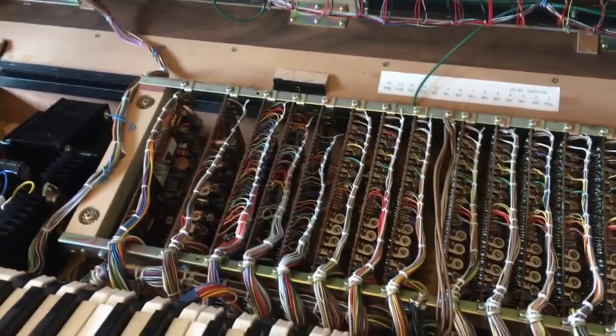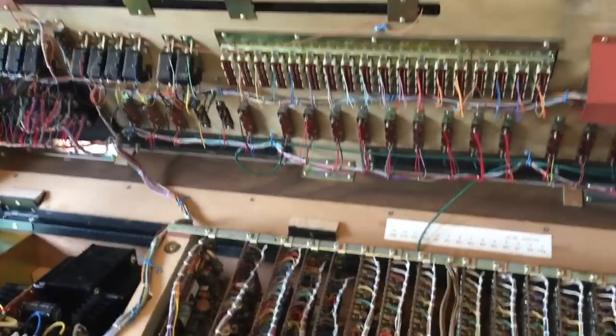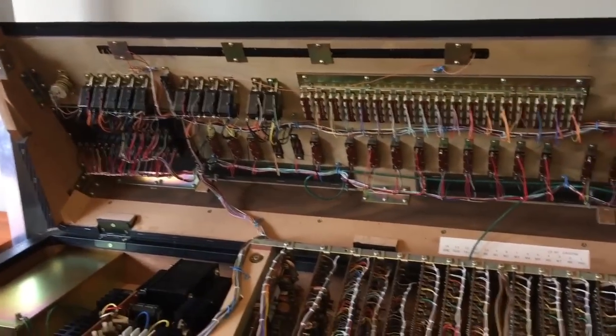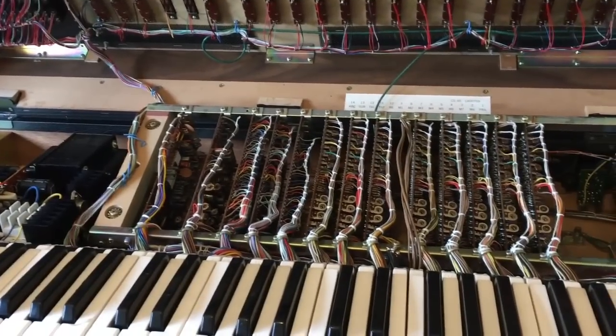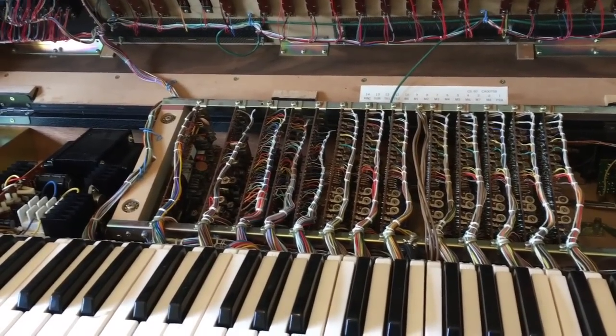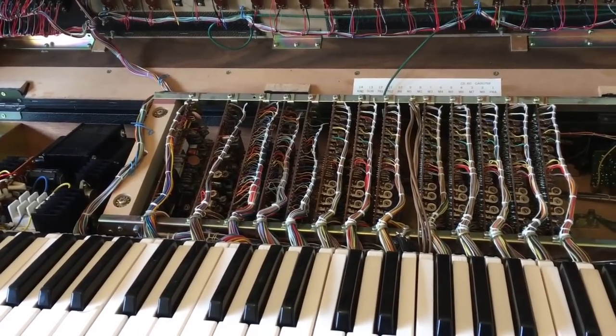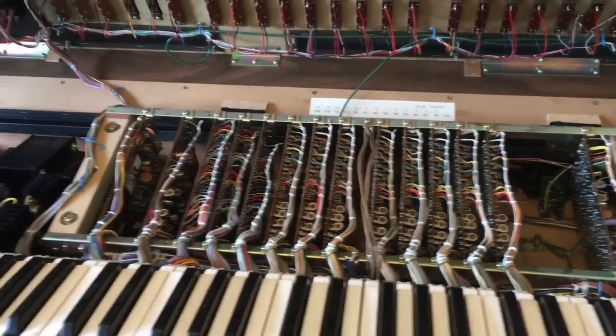It's very different to normal synthesizers. Also, when you get a synth that hasn't been serviced before, chances are it will have the original CMOS chips in there. The CMOS chips from the 1970s were really, really sensitive to static and they died really easily. So it's kind of a perfect storm.